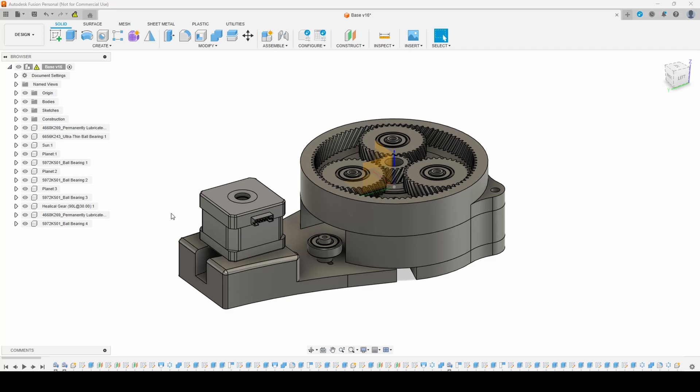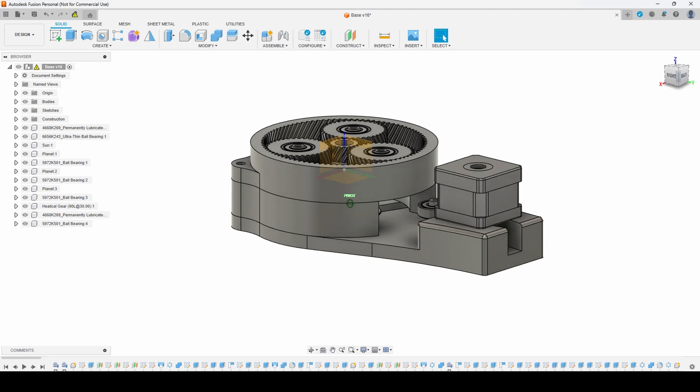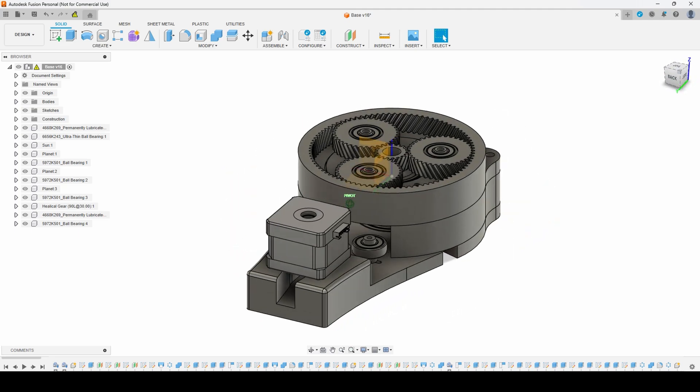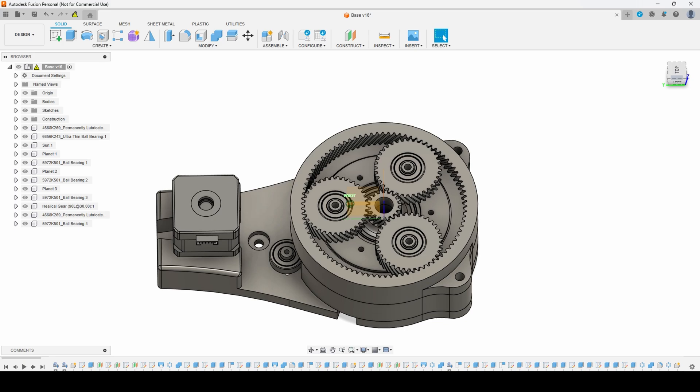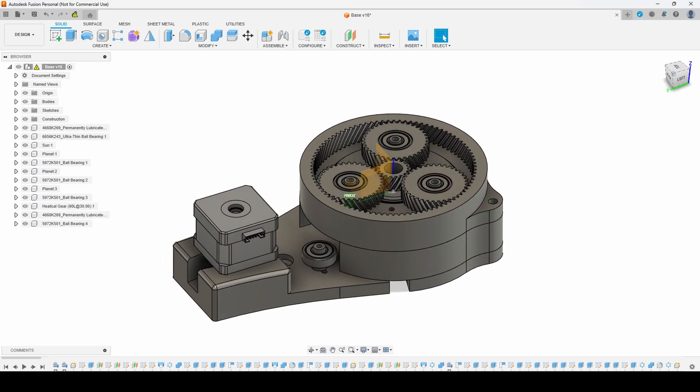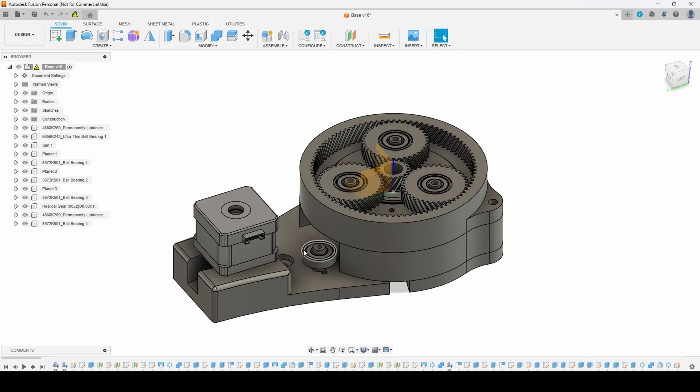This is my base design for the robot arm project. I decided to go with a planetary gearset to mix things up a bit, since they're pretty quick and easy to design. I incorporated a belt as well with a tensioner made from a bearing mounted to the base, but it turns out I didn't need it as the belt had enough tension from the distance I originally calculated.